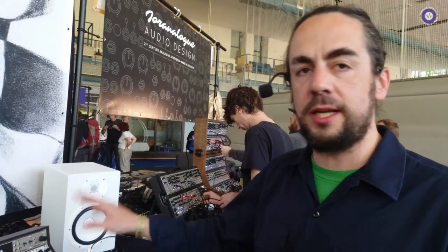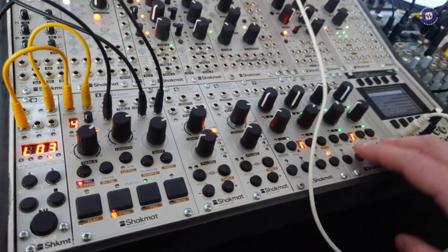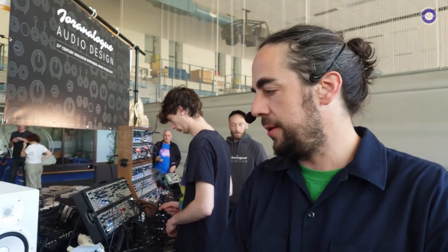It is also SelectBus compliant — with the Harlequin's contacts I can change my presets or filter mode. This is a feature we want to add to almost everything. SelectBus is like MIDI but sent through the power cables between all the modules — it uses the old CV and gate bus that Doepfer created years ago. The Disting has SelectBus, and different modules from Malekko have it too.